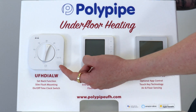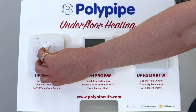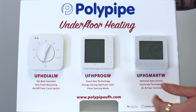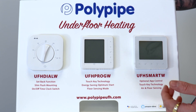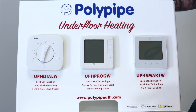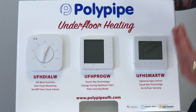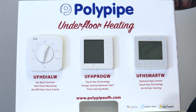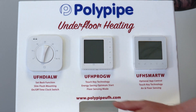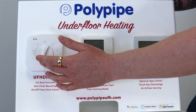First up, we've got our dial thermostat. This allows us to control the temperature in each room by moving the dial up or down depending on how hot you want it. This also coincides with what we call a time clock, which allows us to create time scheduling — i.e. what time we want it to come on and what time we want it to go off. The beauty of this dial thermostat is that setback temperature functionality is built into the unit. So if I set the temperature at 21°C, it will come on when it drops below 21 during an on period, and during an off period it will come on if it drops below 4 degrees — the setback value.